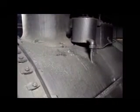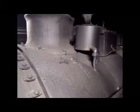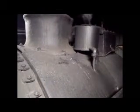And this one and the engine oil, which is a duplicate of it on the other side, runs all the bearings and not inside the steam chest, which is what this one does. So it's not as thick. Basically, the same premise is that it has to be heated up before it goes into the various parts of the locomotive. So, of course, you use steam to do that. So this muffler is an exhaust for that steam, letting the steam out and spitting out all the particles in it, and what's left is water that trails down into this pipe here and empties out the bottom of the locomotive. So sometimes you might see drips of water coming out at the bottom of the engine. Basically that is cleaned exhaust steam that's been condensed and turned back into water. The actual vapor steam is just escaping out the muffler.